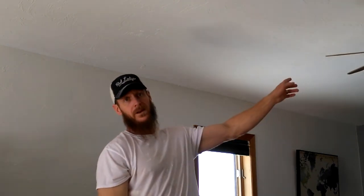Our ceiling's all done — two coats of Eminence on, zero lap marks, good coverage. I've been using this product for a really long time. I know it's a poor test because these walls are textured, but I've done flat walls thousands of times and never had any problems with lap marks. If you guys just follow these instructions, you can't go wrong. Remember to paint in the direction of your major source of light, and laying off is the most important part — after you get that paint on and spread out, lay off in the same direction, do the 50% overlap, and you can't go wrong. Follow us on Instagram, Facebook, and subscribe to our channel for more. We've got a lot coming up in the spring — hit that subscribe button.